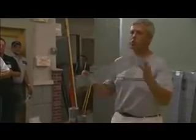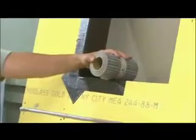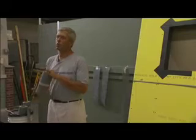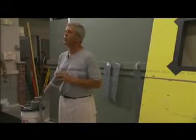The AquaFlash mesh comes in a 4, 6, and 9-inch width. The 4-inch is for expansion joints, vertical and horizontal. Depending upon the size of the framing, the typical 3 and 5/8s that we normally deal with on most projects would require the 6-inch tape. If we've got a 6-inch stud, we'd use the 9-inch tape. Every project is going to need a combination of all three, typically.